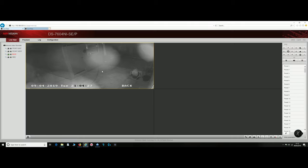There are a lot of videos online that say try Rain-X and coatings, and I've tried Rain-X. There's two Rain-X's, one for glass, one for plastic. I've tried that. Make sure you get the plastic one if you are going to try it. It was debatable whether it helped at all. The drops may have run off a bit quicker, but it certainly didn't stop all the effects we're trying to stop. And also a silica gel bag or granules inside the lens. There's already a little bag of silica gel by Hikvision in the dome cams anyway. It's not anything to do with internal moisture, it's the light reflecting off the droplets on the dome. So there's your solution, and quite a cost effective one.